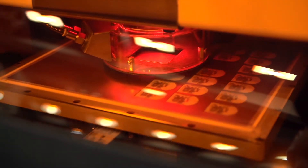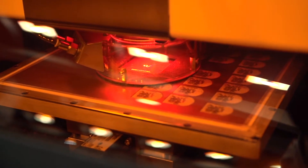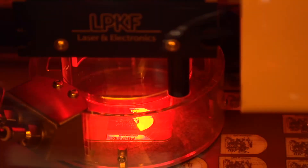With the laser system it's going to do surface metal removal through the hatch and delamination method, peeling away strips with half ounce or one ounce copper and quickly making this design without any resist or any chemicals.